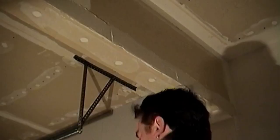Normally, a butt joint, a non-factory edge, would create a bump in the wall or ceiling that you have to try to hide. In our series, DrywallTechnique.com, Series 1, Pre-Rock, and Drywall Installation, we cover the use of butt boards and cover their great value in keeping the wall or ceiling as flat as possible. As you can see, this butt joint is recessed, not protruding from the wall.